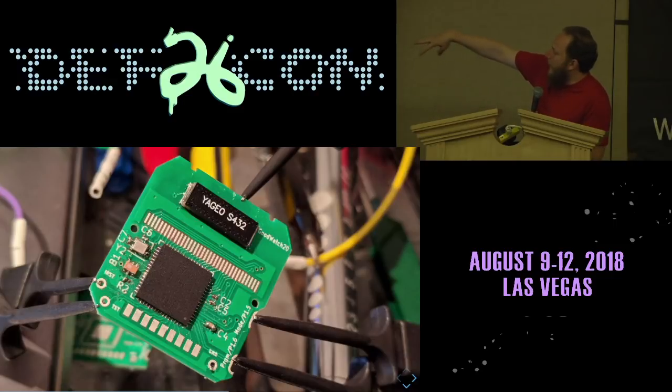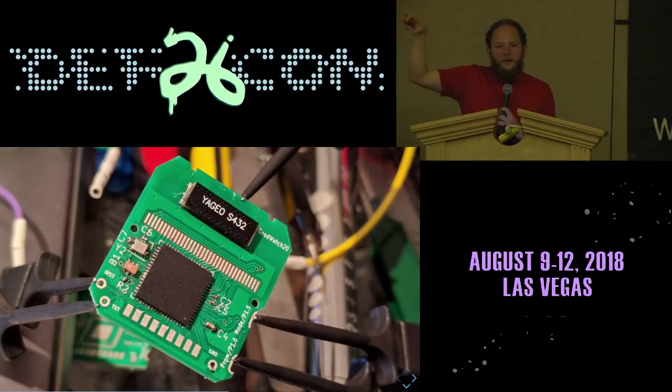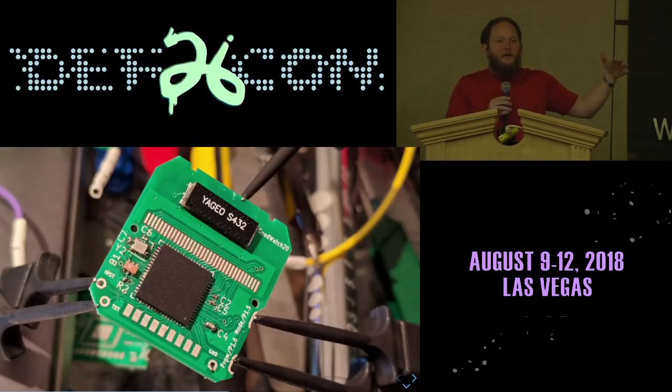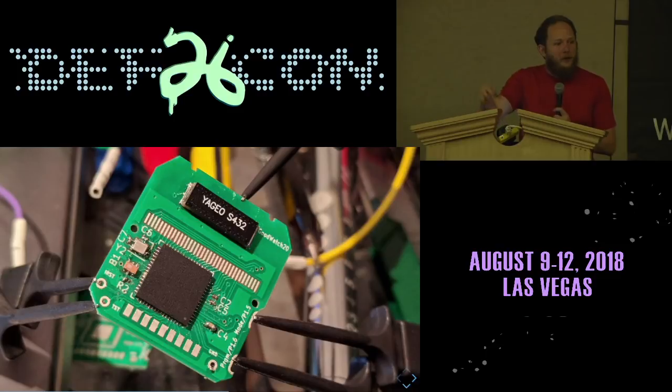And then the actual programming happens through a serial port. So these little test probes that are connected to the sides, those are connected to the pins that allow me to force the chip into its bootloader mode. And then the bootloader appears as a serial port with documented commands. And a Python script can check the model number, erase flash, load in the programming, reboot.